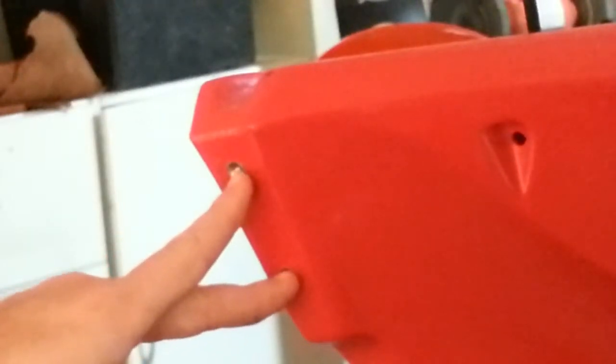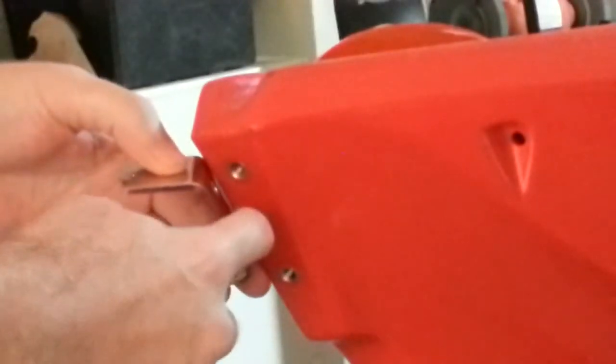So what I'm going to do is make a facing plate. It's going to cover the entire transom with holes drilled not only for the Kayak, but a middle hole for the rudder mount. Now that middle hole is going to be backed from the inside, and hopefully that will span the gap and provide enough strength for a nice solid rudder mounting.